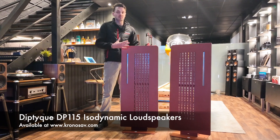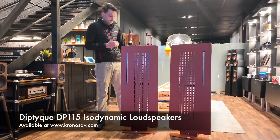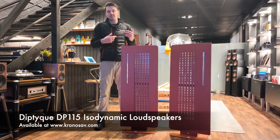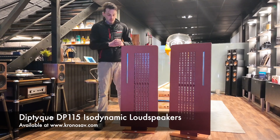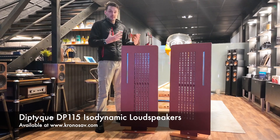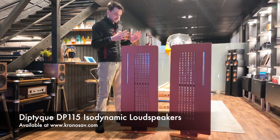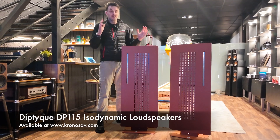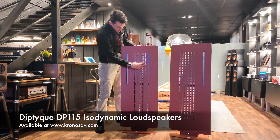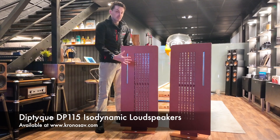In regards to the amazing technology Diptyque are using — as you can see, these are exceptionally thin and take up very little space. A lot of people will be familiar with panel speakers like the Martin Logan range, but Martin Logan most of the time has an active subwoofer at the base, making them deeper because they have to create a box to generate bass. Diptyque found a way around this, which brings a number of advantages. What they've invented is called a bipolar magnetic system — in basic terms, two magnets running front and back with an aluminium foil through the middle and two pieces of plastic beside it.